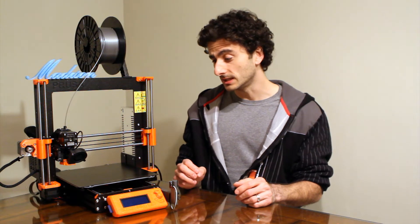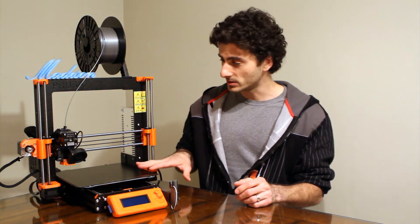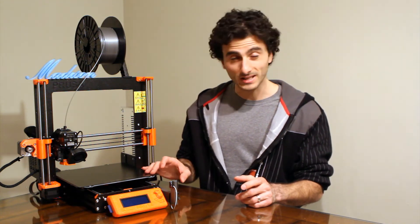Other options I've seen is that folks make a frame piece that connects actually to the bed plate. That way as the bed plate is moving, the frame piece they've made is moving with the bed, and they can mount their camera — like a GoPro or other small camera — to that frame piece. That's a good technique as well, but it has some limitations depending on how strong your support frame piece is. You could get some motion, rocking, or bounce — basically some shake in your pictures as the bed is moving.